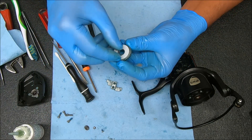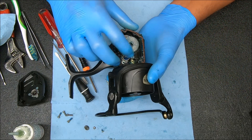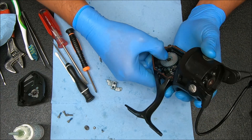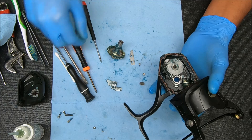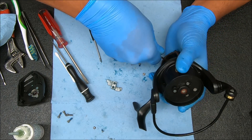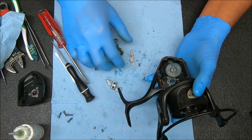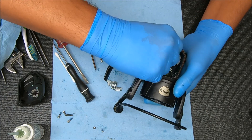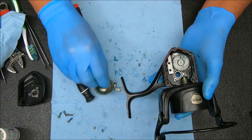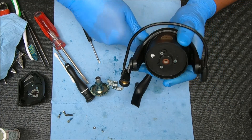So the first thing I'm going to put on will be this little Teflon piece — just kind of put that around it, looking like that. Then we can drop this over it, rotate that towards the bottom. Now I'm going to take this bushing, fit that in there, looking like that. Now we're going to secure with the screw — snug it down, but push down as you do that, it's a weak screw. Added some grease around it. Now we're going to take this bar — put that on looking like that, add some oil to these holes, then secure with the screws. I like to get all the screws in before snugging anything down, so it doesn't offset or tilt the bar I'm connecting.